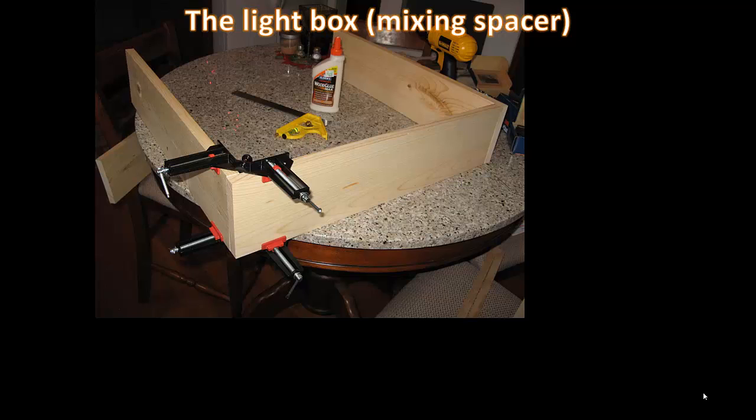Now, you would loosen the clamps, both clamps on the left. You would loosen those, slide the board on the left back, giving you enough room to reach in there and put glue on the edge of that board. Then you would slide it back in tight, tighten those 2 clamps on the left back down, and now you would take and run the screws in those 3 holes.